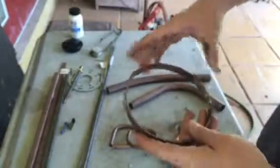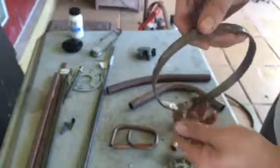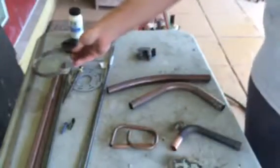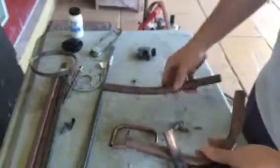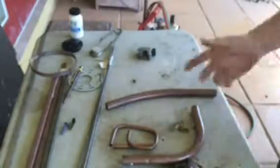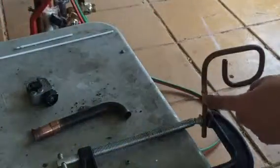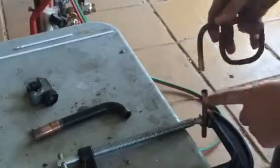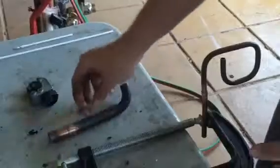This is a ring that I made for holding my oxygen tank in the van on my shelf. This here is the connection — it's a little dirty but it's been sitting out in the rain for maybe about two weeks. I'm going to swage up several of these pipes and try it out on copper to copper and see how the joint comes out. I'll clean up all these fittings, swage a couple, and then get back to the video. So here I have a 3/8 — this one's swaged, expanded joint — and I cleaned it up. I also have 3/4 copper to copper I'll do next.